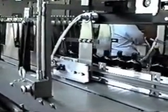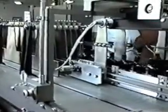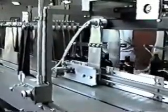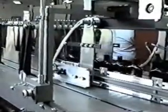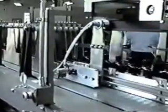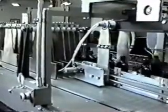On this packer we see small flask bottles being divided into six lanes wide, running at a much higher speed than the previous packer. After counting the pre-programmed number of bottles for each given lane, the lane divider clamps the next bottle prior to shifting the swing arm. This ensures that there will be no bottle interference with the lanes of the packer.